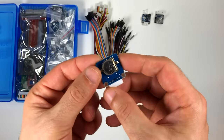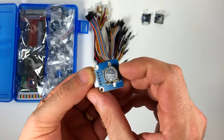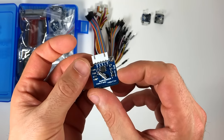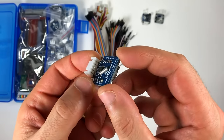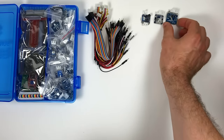This is the DS-1302 real-time clock module. It gives you the date and time — it'll output the current second, minute, day, month, and year. The metal cylinder is the crystal. The Raspberry Pi doesn't have a real-time clock; it gets the date and time over the internet. So this will be nice to have if you don't have access to the internet.